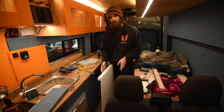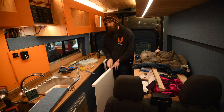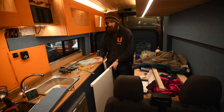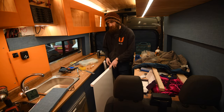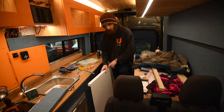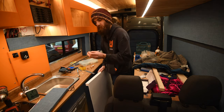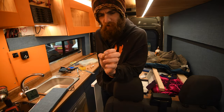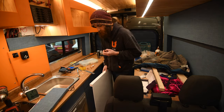Shelves built and painted with some nice washable hard-wearing paint. These are going to be the base of the cupboards on either side so they'll have a fair amount of weight on them. I'm not going to do shelves as such on the inside — I'm probably going to use plastic crates because they take up less room and are more functional. I can remove whatever crate I want and put it back in, which saves building more stuff and is probably lighter overall. For fitting I'm just using little shelf pin things — put a hole in the wall, put that in and rest the shelf on top.